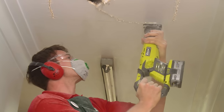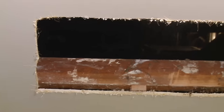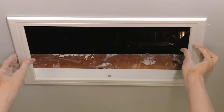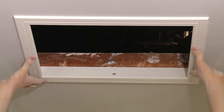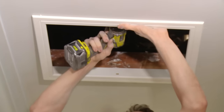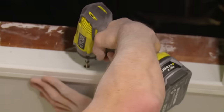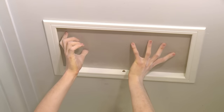Always try to look out for the bits that are going to fall from your roof. Once you've cut out the hole for the access panel, grab your frame and fit it in. Keep making the adjustments that you need in order to fit it in nice and snug. Once you've made sure that the access panel fits, grab your drill and just drill it into the timber up top. Now that your access panel frame is in, make sure to grab your panel, fit it in, and you're done.